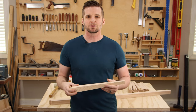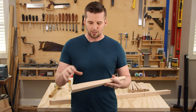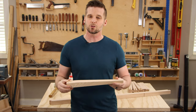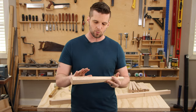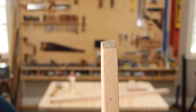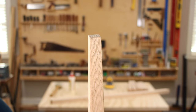I'm painting my base so the highest grit I went was 120, because I want the paint to really soak into the wood. If you're putting a clear coat or stain on, you might go to 220, but you don't need to go beyond 220. When sanding, I made sure to roll over the edges to make them nice to the touch. On the bottom of the legs I beveled each edge so that when dragging on the floor it doesn't tear the fibers out.